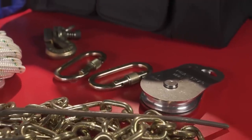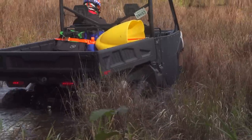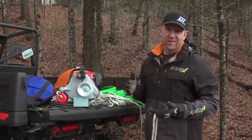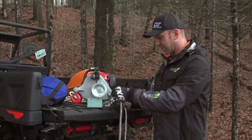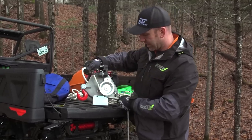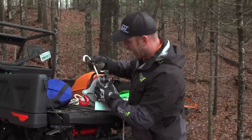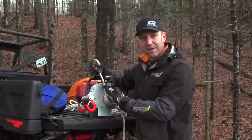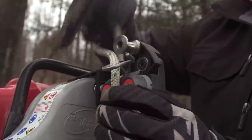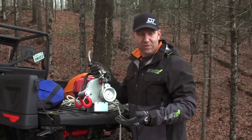The versatility and build quality of Portable Winch products is very high — they have multiple kits available with all kinds of accessories and even an electric option. You can put this winch in the box of your truck, the box of your side-by-side, or strap it to the tunnel of your snowmobile and it'll come through every time. Here's a quick walkthrough of how it works: you take your rope, feed it through the guide, take it around the bail once, twice, three times, then feed it up and around the drum. It comes up, goes around through a little guide, and then there's the special feature that keeps it from backing off — the anti-rollback lock. If you're pulling a wheeled vehicle like this Defender uphill without that lock, the cable could go backwards and you'd lose whatever you're pulling, sending it rolling away downhill.